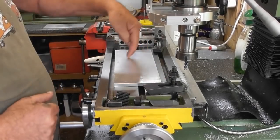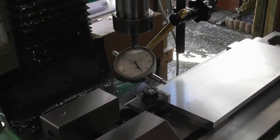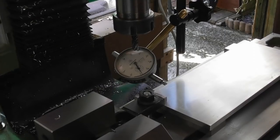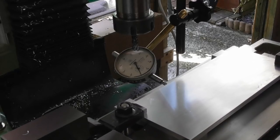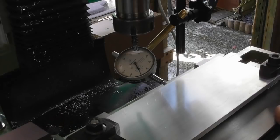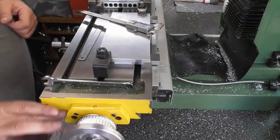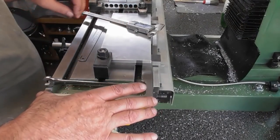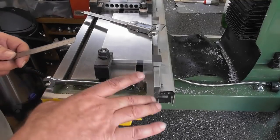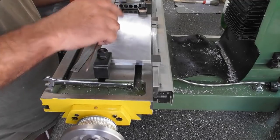So I'm going to set this up now to cut out a pocket that's going to be the same shape as that — making it up as we go along. Just clocking it in. We need to mark out this shape on this plate in the right place. The table is 180mm wide. If I just come from the end here, that oil nipple is sitting smack on 90mm, so I know that the shaft is at the centre of the table.